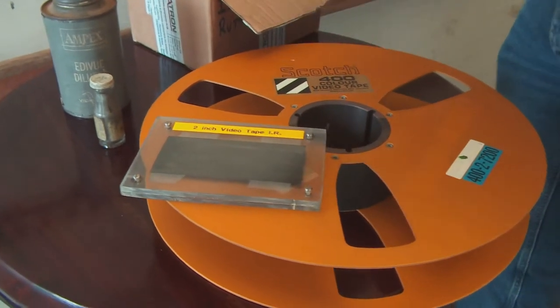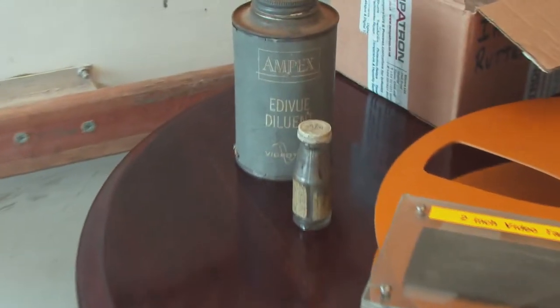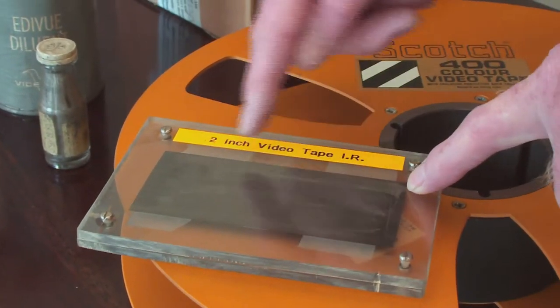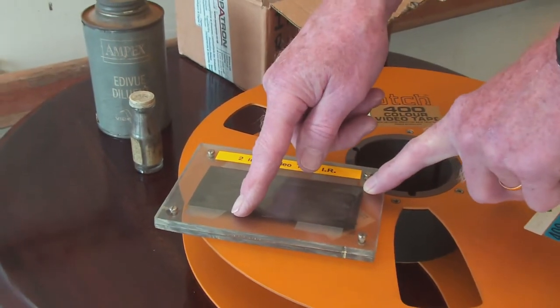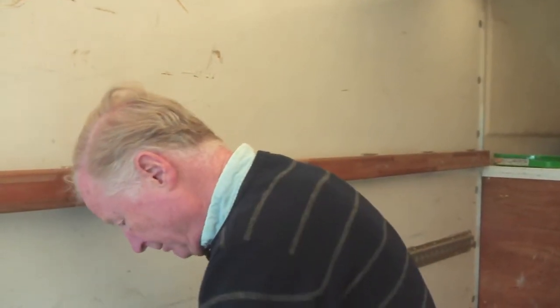And then you put that tape into the cutting machine and you peer through a microscope and you'd see those tracks. And to give you a clue where you were, you would see edit pulses at the end. You found these tiny little pulses under the microscope, and then you guillotined the tape. Great. So that was the out point. And then you found the new material. You went up and down, found the bit you wanted, marked it with a china graph, put it in the machine, guillotined it, and then you stuck it all back together with sellotape, effectively.